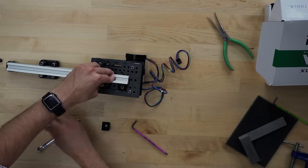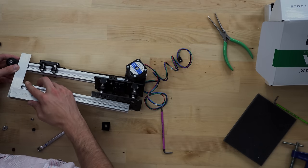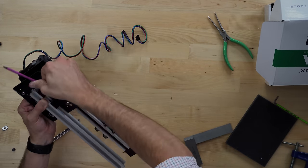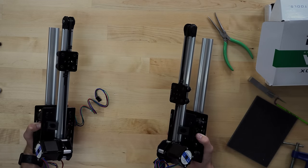An interesting design element of this printer is that the extrusion drives will ride on separate rails parallel to the X-axis we just built. So an extra rail needs to be attached to the opposite side of each Z carriage. We will talk more about this design choice when we add the extruders and drives to the frame.